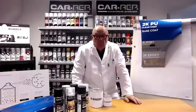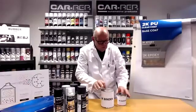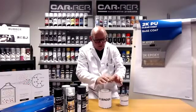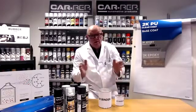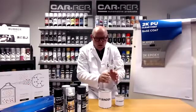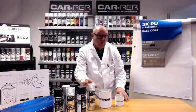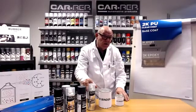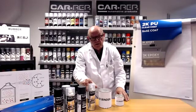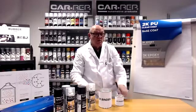So let's see where we are now. Once more: two components, packed separately, have to react with each other — pot life. Aerosol, two compartment — also pot life. Our products: no pot life. You can use it, you can put it away. Two weeks later you need it, you shake it, you use it, and you can use it again. And that's of course a big difference with the conventional products on the market, and the result is a full grown 2K product.